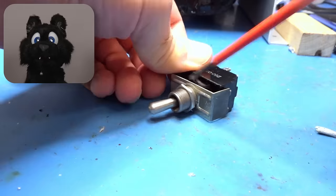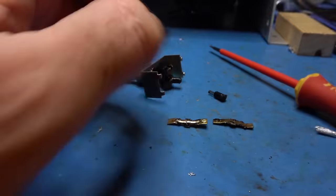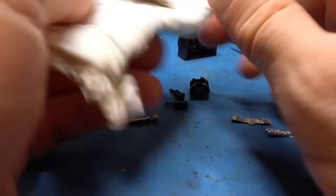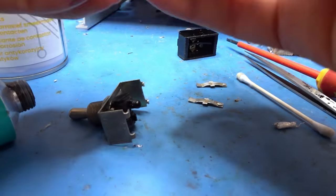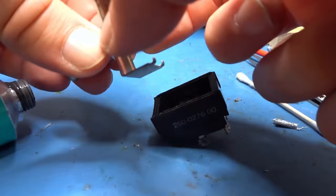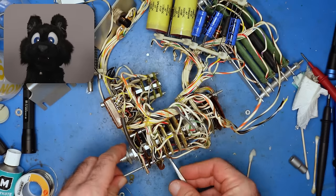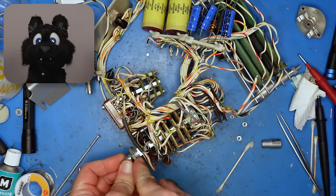After the recapping, there's plenty of switches to clean and potentiometers to lubricate. I thought I could forego the wafer switch disassembly this time, since they are really accessible for Q-tips, but I really wanted to get that old grease out of there, so the shaft and case need to come apart.